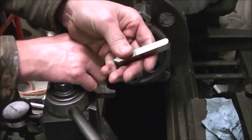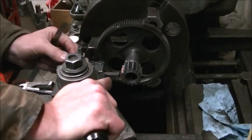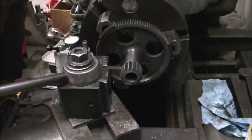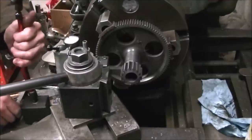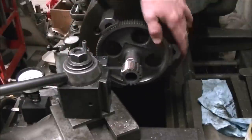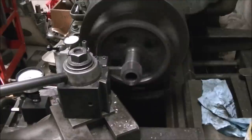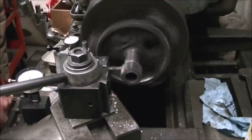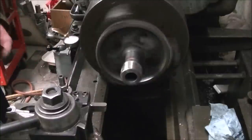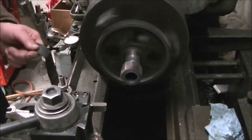With that trick I could go in, touch the center of the bore, then back it off and get back in consistently. Then I found a high-speed steel tool with a radius on the end that I could use to go in and clean up the very back edge of the teeth — kind of went in there and cleaned off the braze, as well as a lot of the flux that had run down around that part. Then gave it a quick hit with some emery cloth to clean up what was left of the flux.